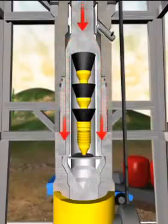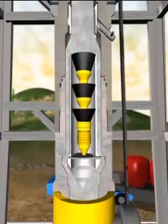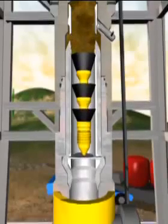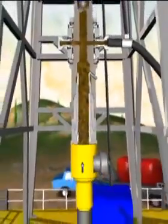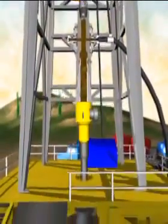The cement flows around the pump down plug, which is resting on a flapper inside of a sliding tube. When the required volume of cement has been pumped, the plug lock is turned, the tube drops, and the pump down plug is forced out of the TD plug dropping head. The flag sub provides visual confirmation that the plug has been pumped down the drill pipe.